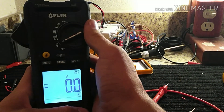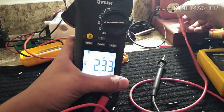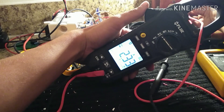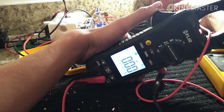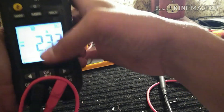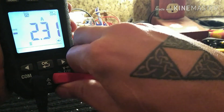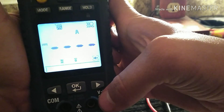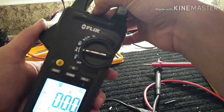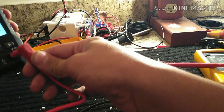You have your AC/DC voltage, and you have your amps. For AC amps, it's not going to have enough current to read right now, but you've got AC amps and DC amps — that's a great feature. On your DC amps, you can use min/max. You remove your leads because you always take amp measurements without leads, zero your DC amps, then put your cable through the clamp jaw and turn on whatever you're measuring.